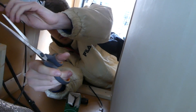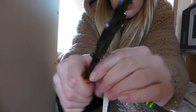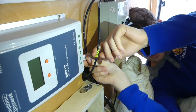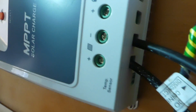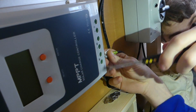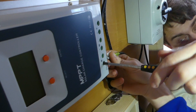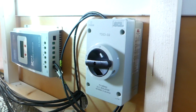Here we're cutting the wires coming out of the isolator to fit perfectly into the MPPT controller. We stripped these wires back and inserted the positive wire into the positive terminal of the MPPT, which clearly shows these wires link up to the solar panels. We loosened the screws first, inserted the wire, then tightened the screws to correctly attach the wires. We did the same for the negative wires.